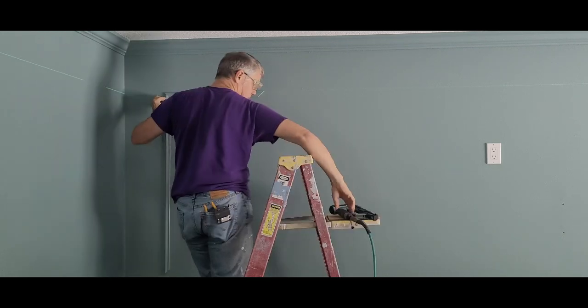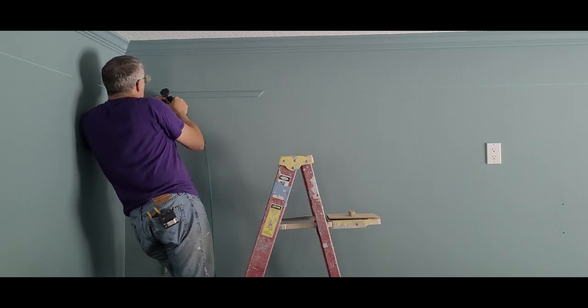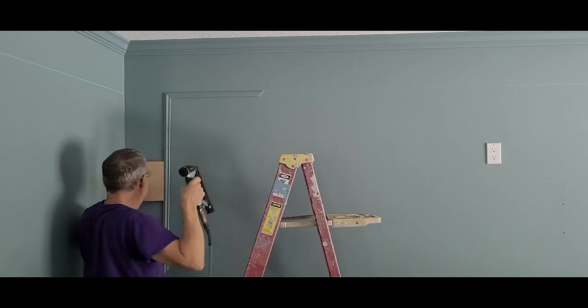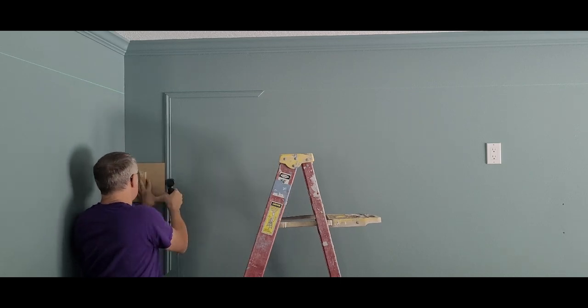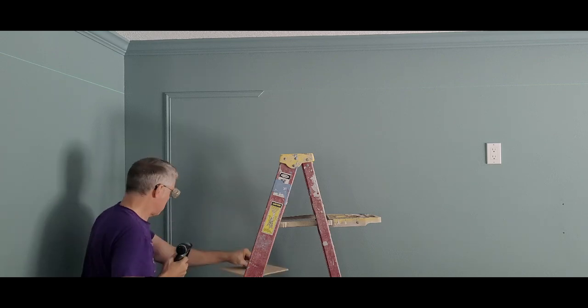The next piece to go in was the side stile. I got the miters nice and tight and set the first pin. Then I used my spacer to ensure that the strip was parallel to the corner. You could go plumb and level, but this keeps things straight to the eye.